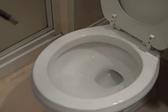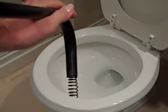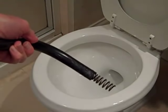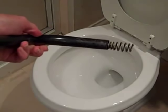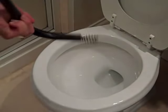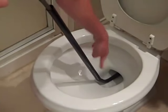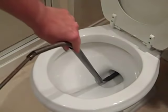When you start out — when I hang this on a hook in my garage, let me show you how I usually hang it. It's typically all the way open. You want to pull the snake back so that only the coil piece is showing. This plastic part protects the porcelain of the toilet from getting scratched by the metal. The first thing you want to do is pull it back and then set it inside the bottom of the toilet, so you've got this plastic part protecting the bottom of the toilet.